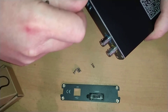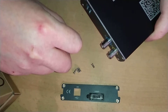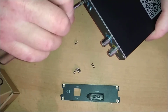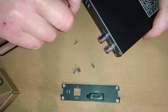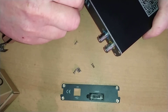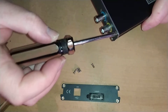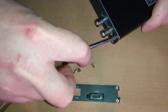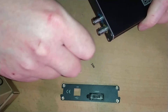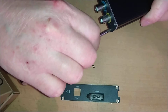It's a good oscilloscope. It's not got AC coupling on it — there's some sort of mod you can do to it with solid-state relays and capacitors; I saw it on the OpenHantek page. It's not got AC coupling as standard. I'm personally not sure how that affects me. I suppose if you're measuring AC signals a lot of the time it affects you a lot. This is brand new — I've just had it about three days.